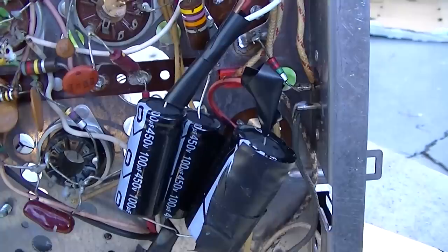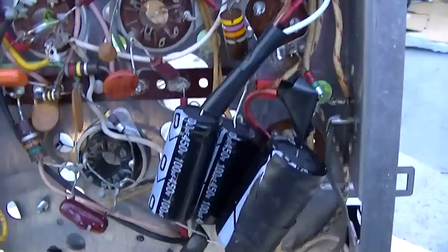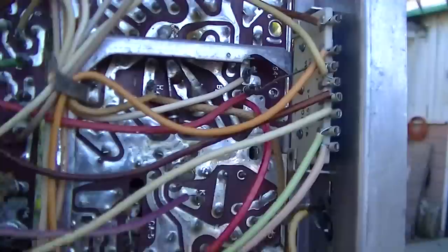Generally, I believe on mine I did have to change the voltage doubler circuit because it does run a lot of current through there, and it does burn those capacitors out. But generally in RCA, I had to change very few of the electrolytics. I know about the hyperventilating that goes on if you don't change all the electrolytics, but I've had pretty good results with not changing them.